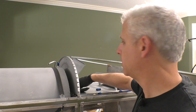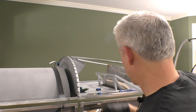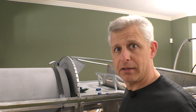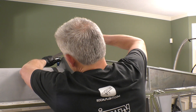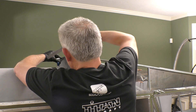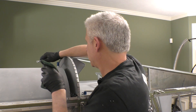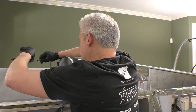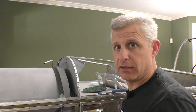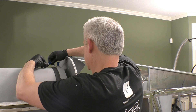Now we need to prepare the aluminum tubing. If you're going to flare anything, it's very important that the outside be absolutely perfectly smooth and free of burrs, otherwise that's going to crack when you go and spread the pipe. So I'm going to take this and carefully run my file across it until I've got the edge perfectly perpendicular and perfectly smooth, then clean it up nicely with a little bit of Scotch-Brite. First goes on our B-nut and then our collar — we've got the B-nut and the collar in place.